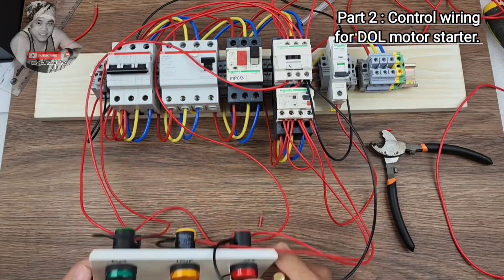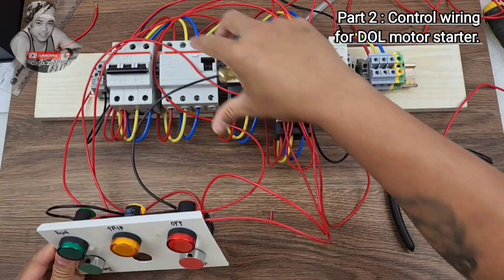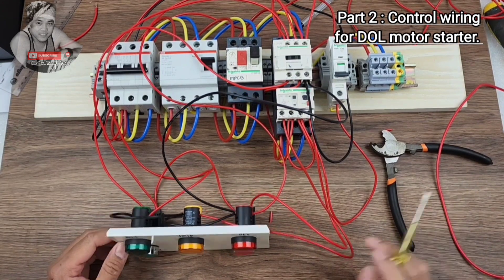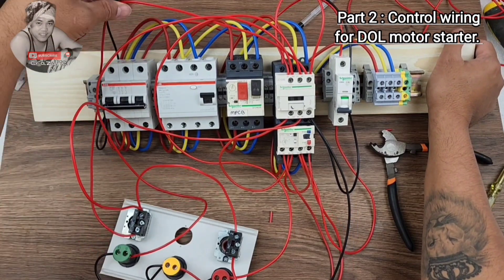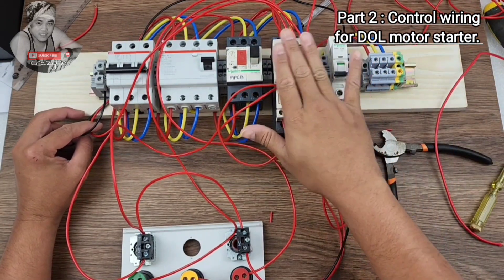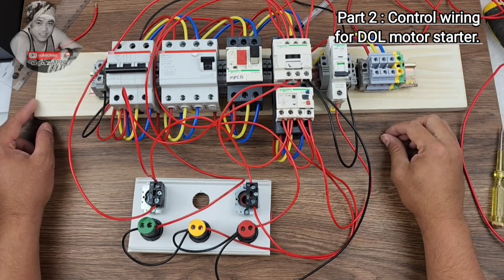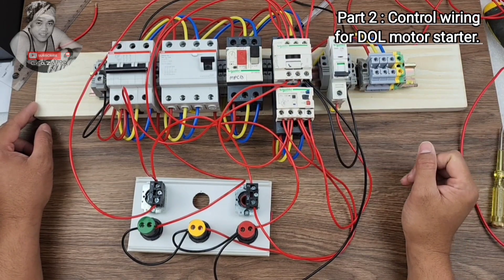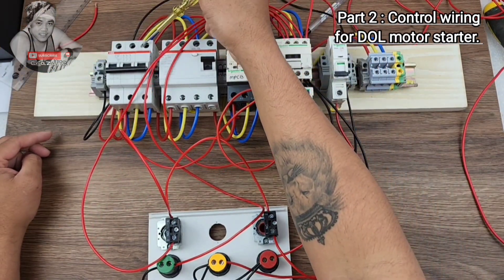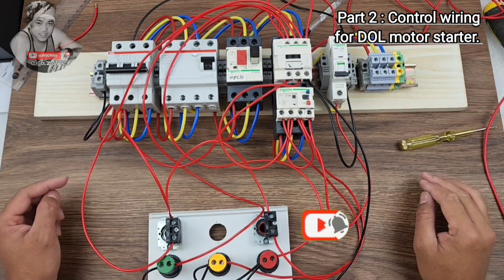We have the control wiring complete. This is in your door and this is the internal wiring. It looks a little bushy, but when you do this on actual wiring it will be arranged properly. We have the control wiring done: main neutral and power for the main control, looping all the way to your contactor. For my next video, we will do the practical testing for our motor. DOL control wiring is done. Power wiring is there already — all we need to do is input power RYB, neutral, and the DOL motor RYB.